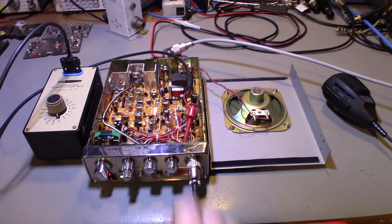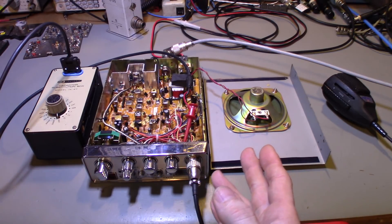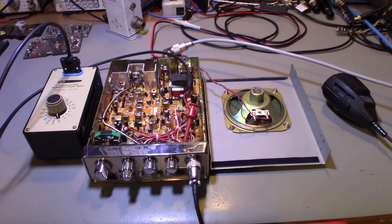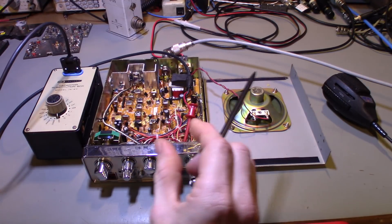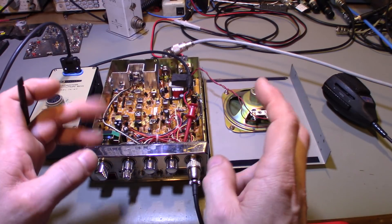As the video title says, this is about adding a filter circuit to your radio. Another shop is claiming they do a 'super tune' to remove noise from the receiver, but honestly there's only so much you can do by aligning a radio. You adjust for maximum signal-to-noise — maximum audio with minimum noise — but if somebody's claiming something phenomenal with their secret tuning, they're just lying to you flat out.